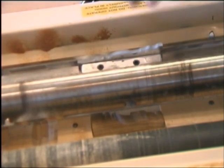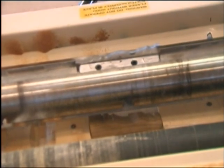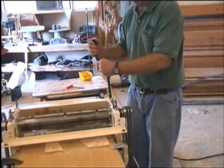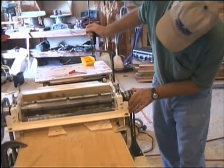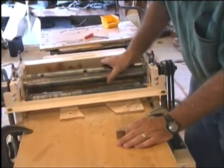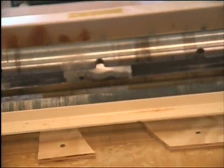Remember, the thin edge of our casing trim from around a window or door is always going to be to the inside of the radius. There are times when you make a piece of curved molding where you need it to go the opposite direction — just remember which way the piece of molding is going to run when you set up your guides. To get our profile right, I think we'll need to come about half a crank, maybe a third of a crank more in depth.